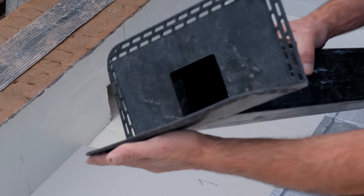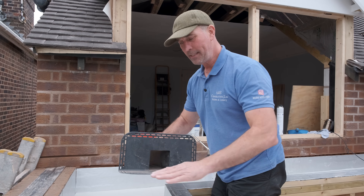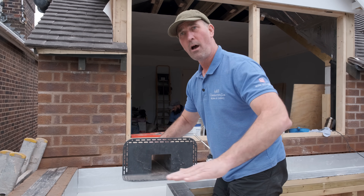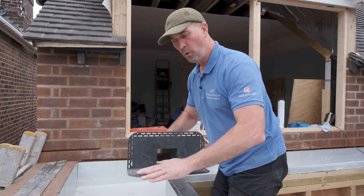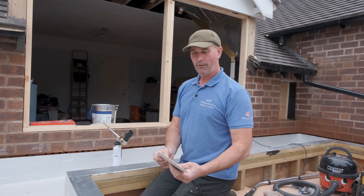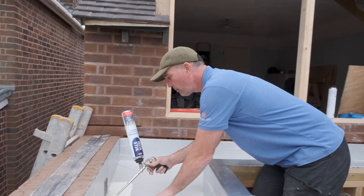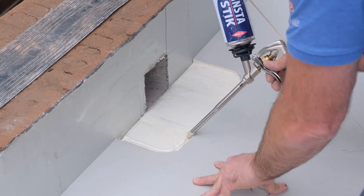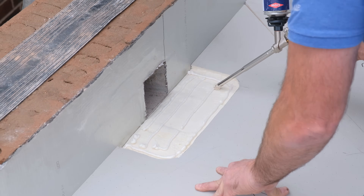The reason I've cut that bit out is to make sure this piece is recessed into the material so when the Resitrix is fitted it comes up as one whole continuous layer — nice and smooth with no ridges for water to try and get over, which also stops it collecting rubbish. I've cleaned the back of this piece.